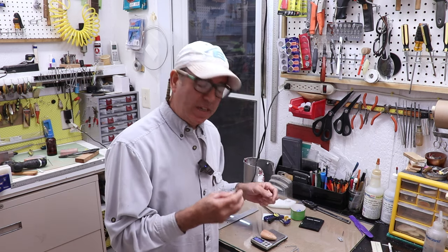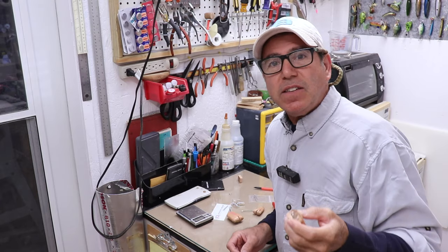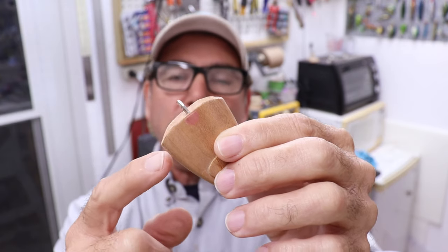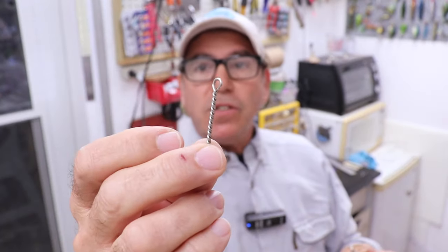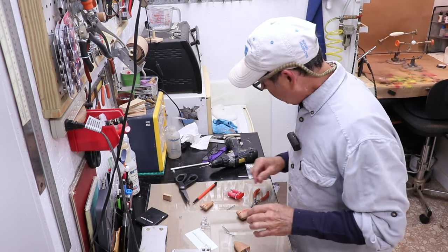I'm going to take the density of the wood and, knowing the weight of all the wood, calculate the volume. I've got one more hole to drill — the hole for the actual belly hook. Wherever I can, I like to do double duty with that screw eye. That eye goes right below the hinge plate, and I want to lock in that hinge plate. Whenever I can lock in two things at once I do it — so I'll drill a hole through here that goes through the hinge plate, and when I insert this little screw eye it'll hold the hinge plate and the hook. It's a nice trick because whenever they're both under load they kind of lock each other in.